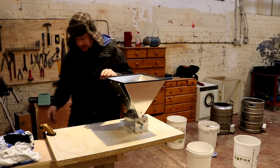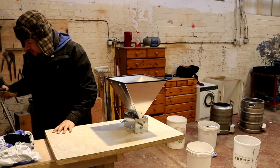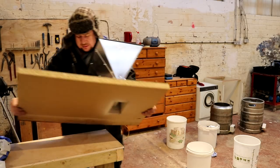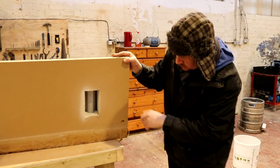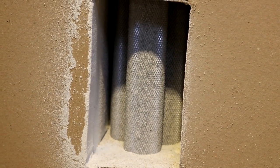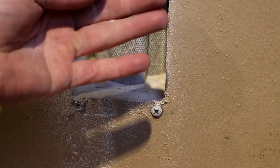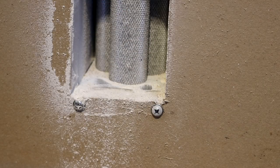Impressed with that mill. All of the malt's gone back in the sack. So what I'm going to do now is have a look underneath at exactly how the rollers stood up to the milling and have a look what's left in. And there's not a lot. So there you can see, very little overspill, very little flour left behind. Just a little bit here, which has banged off the top as well. And I think you could make bread out of that. But all the husk obviously is in there with the wheat kernels.